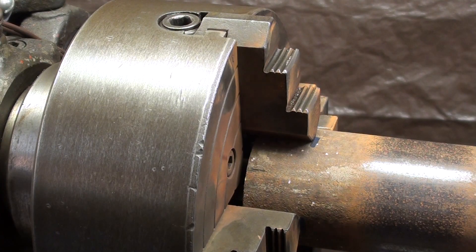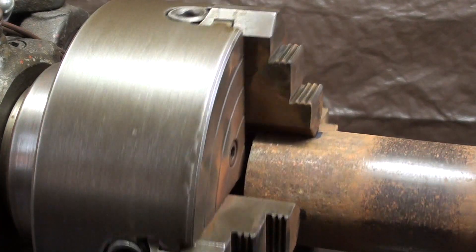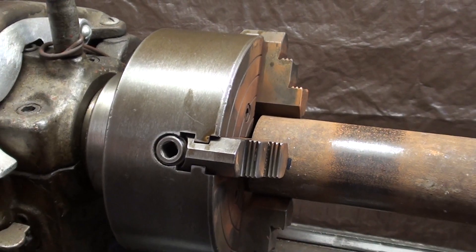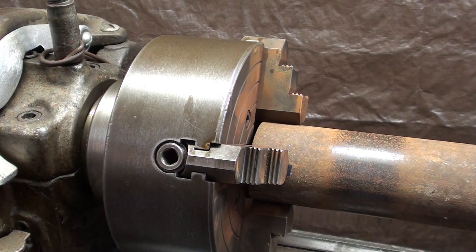I think I forgot to tell you — notice there's a little distance right here. Well, the work did not creep. I started out that way because, in fact, I made just a little bit of a Sharpie marker by each jaw to proof and make sure that it's not creeping out. It's rather alarming when that happens because your work appears to be growing. At some point, depending on how bad it's creeping, it might actually break the tool or something like that. So I hope you enjoyed the video and understood what I was talking about. Make yourself one of those feelers if it would help you with your setup. This is Mr. Pete saying so long for now and see you next time.